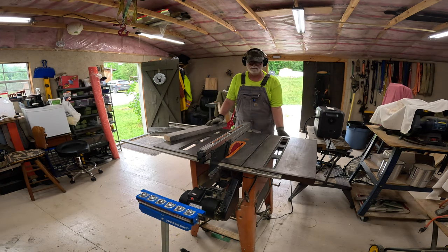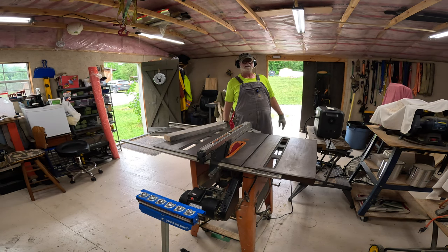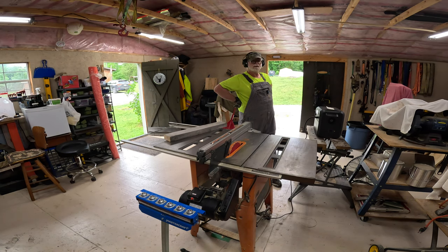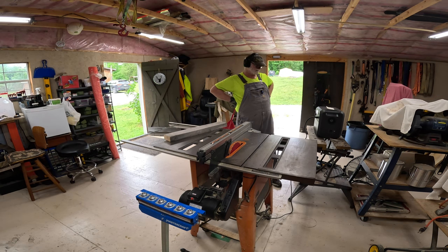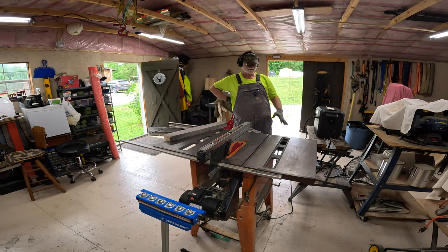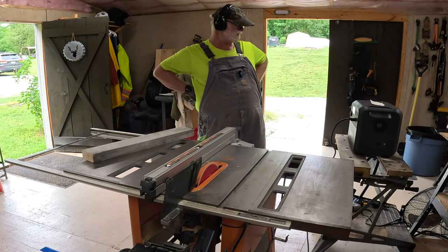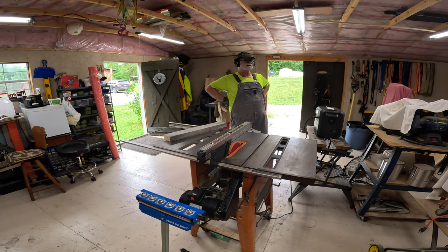It tripped out. Yeah, so that went down on overload. So I should be able to turn it off, turn it back on. Okay. Everything came back on just fine. We're back to AC output. Let's try it again. There's 15, 16, now it's going down and tripped out. Hasn't quite got it to do that.